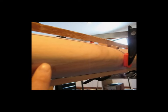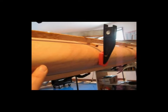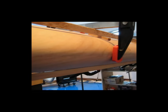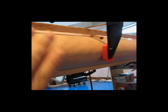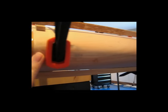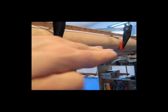Now this center line, when I drape this plywood over my bending jig, this center line lays on top of the bar. It's actually not a bending jig. I actually use just a solid bar from some of my free weights. But this drawn line gets centered over the top of the bar, and then the plywood just gets bent around that. This line provides me a reference so that from one end down to the other, it doesn't twist or walk. It doesn't end up curving one way or another. I keep it nice and straight.